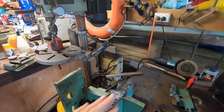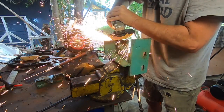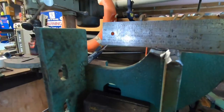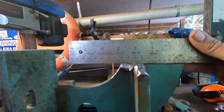Now I'm going to start grinding all this dodgy plasma cutting off, give ourselves a bit of a bevel to weld to. Just having a look at how flat our surfaces are now. We've got a dip on that left hand side, but I'm going to deal with that in the welding - I'm not going to bring everything down to match it.